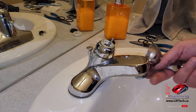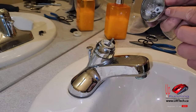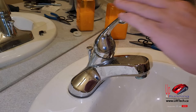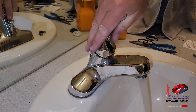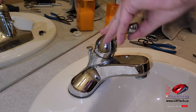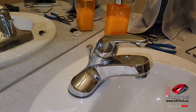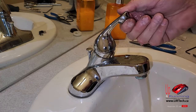I'm going to make sure this isn't leaking anymore by just putting the handle on — there's just a hole and it goes on that pin, staying on because the set screw catches the notch. Before I do anything else, turn the water lines back on underneath the sink. I should probably turn the faucet off first — there we go. That looks good. Swiveling nice. No more drip. Nope.